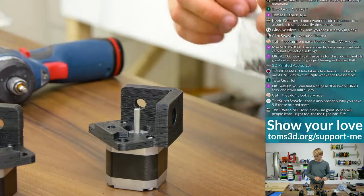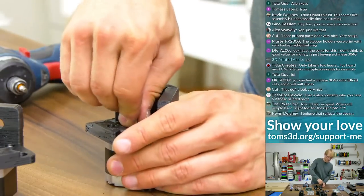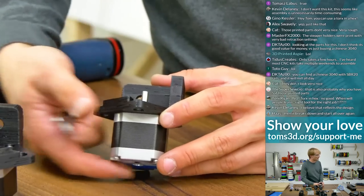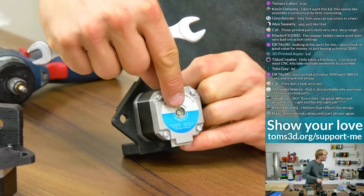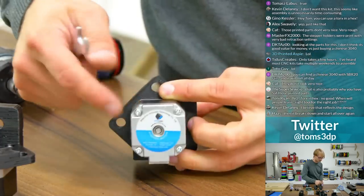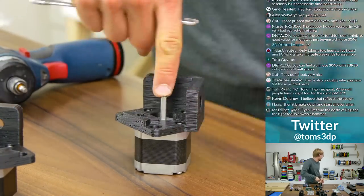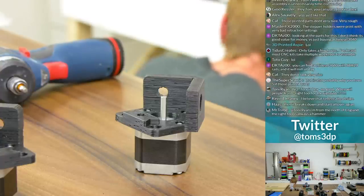So we don't seem to be having any other thrust bearings other than what the motors themselves have. And usually these motors have a little spring washer in the back. So there are two bearings in here. There's one in the back. You can actually see it right in there. That's the motor shaft in the center, and then there's the bearing around it, and there's another one right up in here, and typically there's a spring washer on the bottom here. So as I push this down, typically on a stepper motor, you'd see the entire stepper shaft getting pushed into the motor body. So if I grab another stepper,